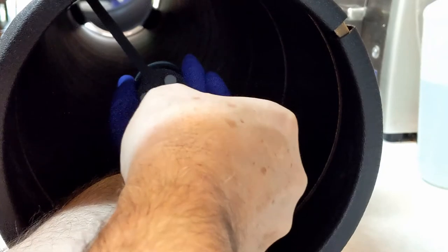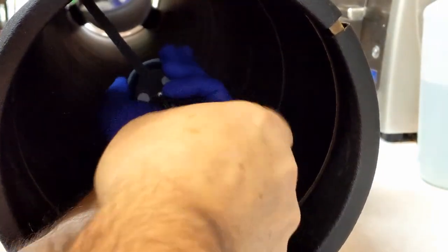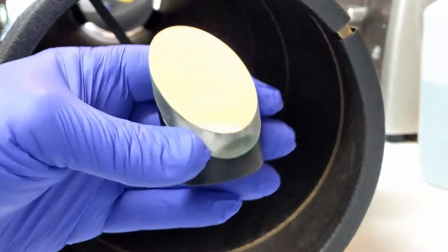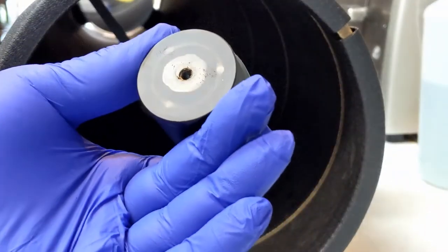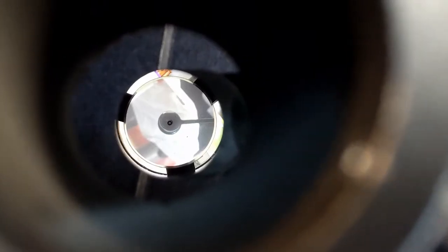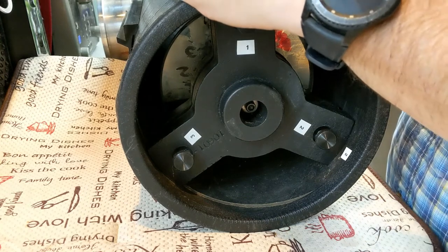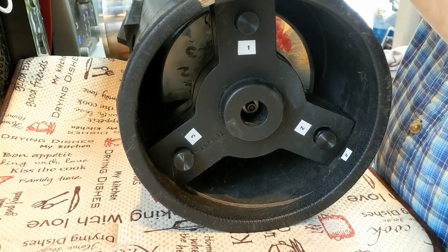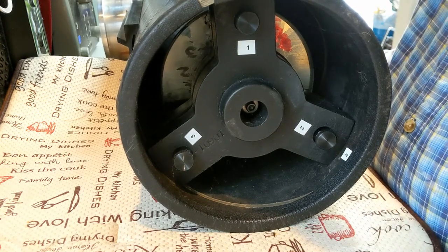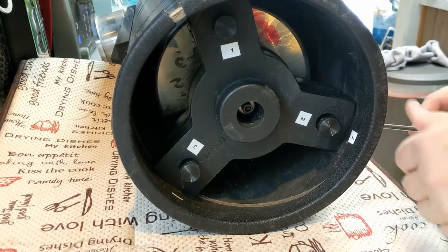What we're going to do is take out the secondary. I'm going to go in with a gloved hand and a Phillips screwdriver, trying not to touch the mirror with the gloved hand, and pull out that center screw. While it's not necessary, I recommend using a label maker or a Sharpie and tape to mark your mirror and the tube so the mirror comes out and goes back in exactly the same way — it might help reduce how much collimation you need to do in the end. Here I'm pulling the screws and rotating the scope ever so slightly.